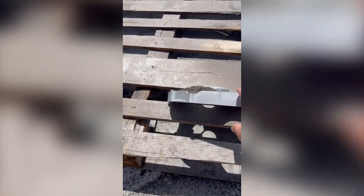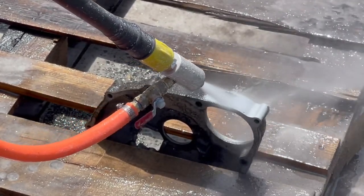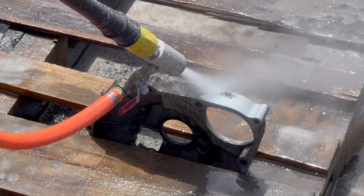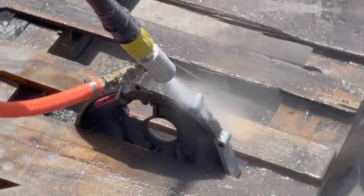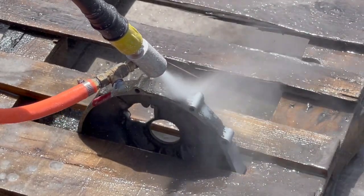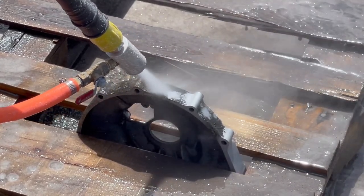There's also a ton of paint on this part and the paint is very stubborn. So we switched out the glass bead mixture with some aluminum oxide mixed with a couple other things, giving us a pretty aggressive mixture to rip this paint and gunk off the part.